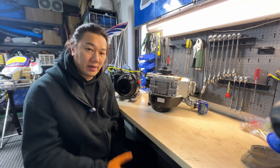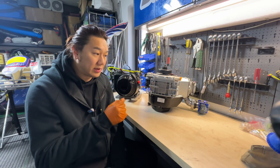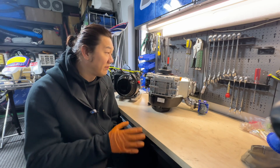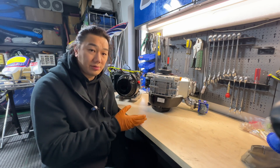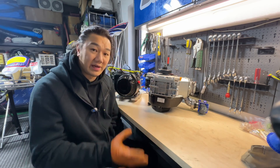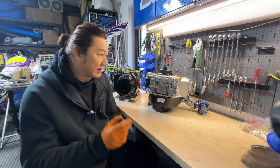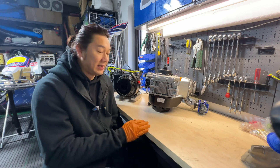Theoretically, getting an extra two horsepower is not a long shot. With the clutch we also did some modification — we reduced the coil numbers by two to make it tighter, so the engagement RPM should be above 2000, hopefully somewhere around 2800 or 2900. The shoes have been cut so we can increase contact points — now we have nine contact points as opposed to the original six. It's a small modification but should give us much better response on track. Now that the oil has been settling, it's time to open up the case and check those two things.